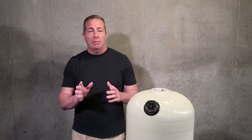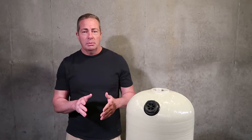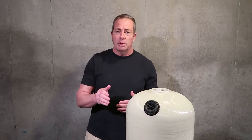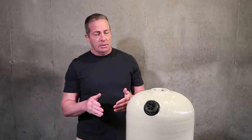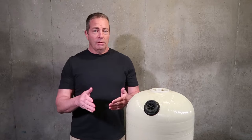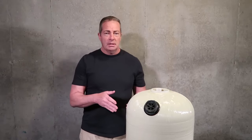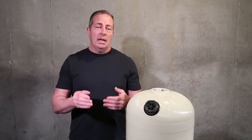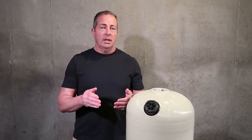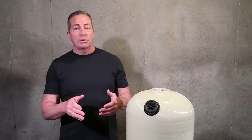people don't realize that a backwashing acid neutralizer, even if it's the smaller 1.5 cubic foot, whether it has an electronic control valve or a mechanical control valve, is going to discharge 100 to 140 gallons or more of water during the backwash process. And typically most units have a 10-minute backwash and a 10-minute rapid rinse, and typically it's going to be at 5 to 10 gallons per minute, depending upon the size of your neutralizing tank.